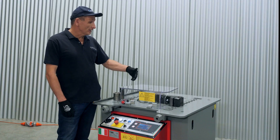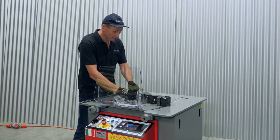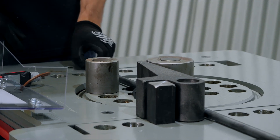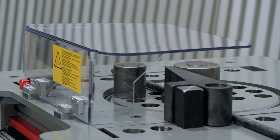That was a successful dry run. You can see the machine rotated without fouling with any of the other tooling and retracted correctly, so now you can proceed further. Place the external bending bush into position, place your bar into the machine, close the guard, and start the bend.